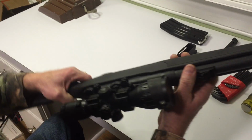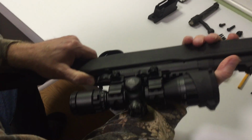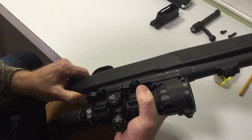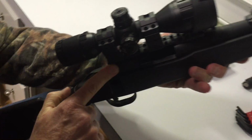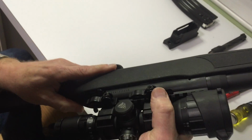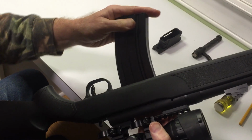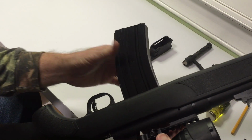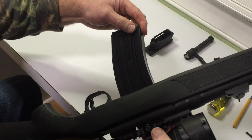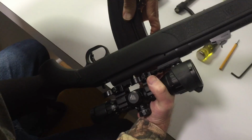Hello everybody. I recently traded for a Mossberg MVP in 5.56, and as you've seen in other videos, here I've removed the bolt to make it safe, and also these 3 screws so you wouldn't have to sit here and watch me remove those. As you've seen from other YouTube videos, the magazine fits very sloppily in there, and every time the magazine moves down like that, the bullet digs into the ramp and will not chamber.